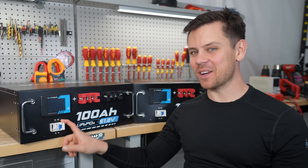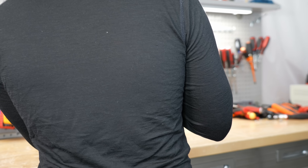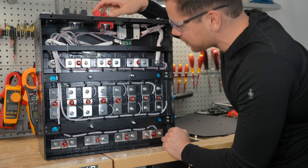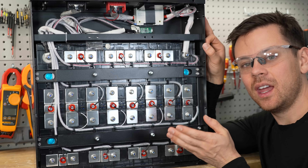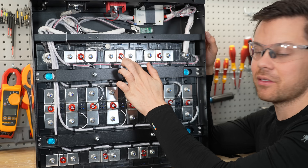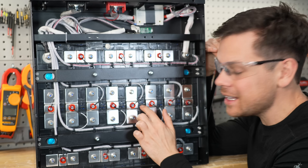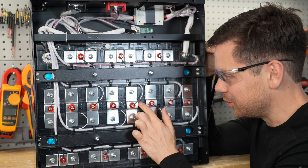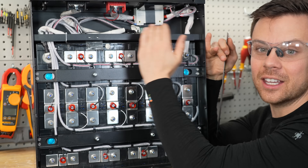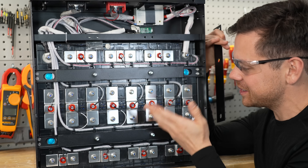Now we can open this thing up and see what's inside. These are locking nuts — that's nice. I think this is better than the Eco-Worthy. On the Eco-Worthy, they have flat bus bars that do not allow for expansion and contraction. These actually have them. We also have locking nuts on every single terminal. There's padding between the cells, plastic cell holders, steel bars, and a steel case — no open air like the Eco-Worthy cells. Really, this is overkill. I don't think I've seen one with this much support around the cells.